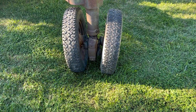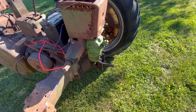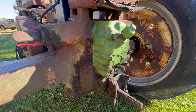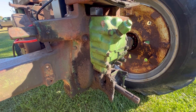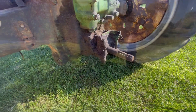It's a Roll-O-Matic, so we've got suspension. And it is a Power Trol, so we've got that going for us. I'm kind of suspicious of what's going on here because that looks like it's never been off the tractor and that looks like it's been off the tractor recently. We've also got the remnants of a little PTO deal that covers the PTO shaft.